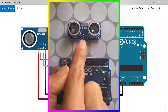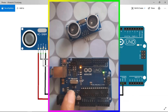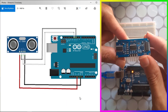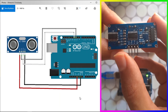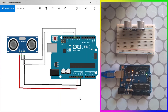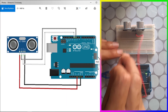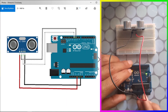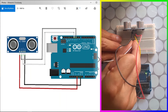You will need the HC-SR04 ultrasonic sensor, an Arduino, and a breadboard. Fix the ultrasonic sensor on the breadboard — VCC is on the right side, GND on the left, then trigger and echo pins. Connect VCC to 5 volts, then use a black jumper wire from GND of the sensor to GND of the Arduino. Connect the trigger to pin 10 and the echo to pin 11.